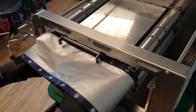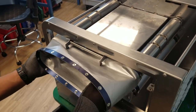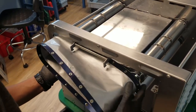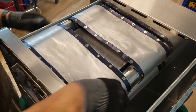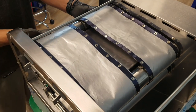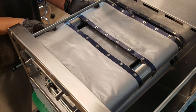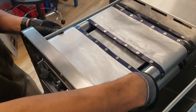Reinstall the belts one at a time. Confirm that both belts are properly installed in their respective grooves, then push down on the roller shaft to apply tension. Reconfirm they are correctly aligned.